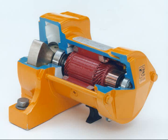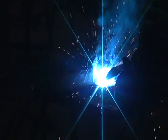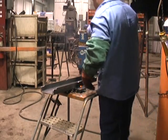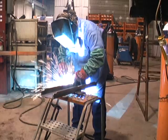The fabricated C-channel has been notched so that it can be welded to the two spines that run down the center of the dump body. The vibrator mounting plate is welded to the C-channel. The mounting plate is tacked in place, and then a full weld is placed on each side. Note that mounting bolts were installed in the vibrator mounting bracket before welding. This protects the threads in the vibrator bracket mounting holes throughout the body preparation process. Once the C-channel assembly has cooled, it is fitted in place between the body spines.